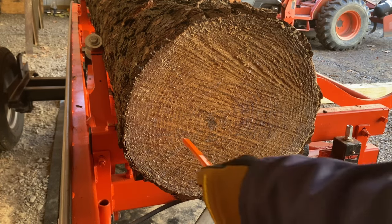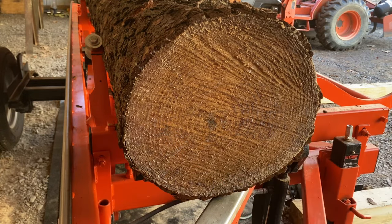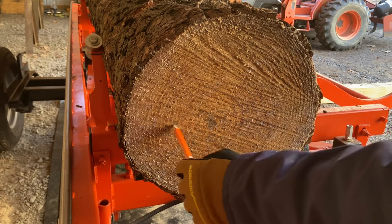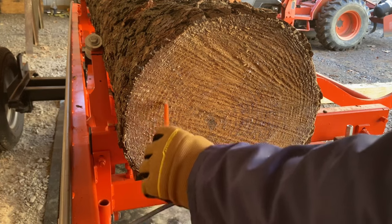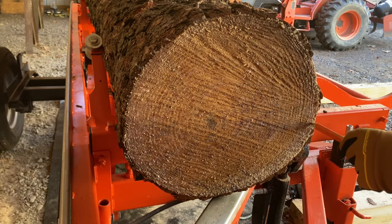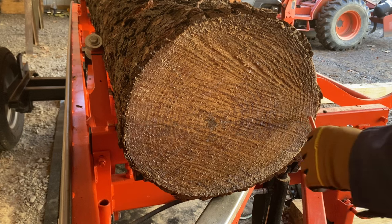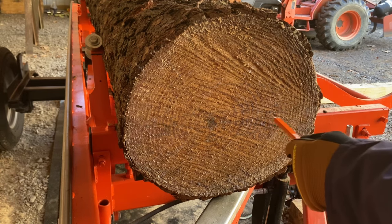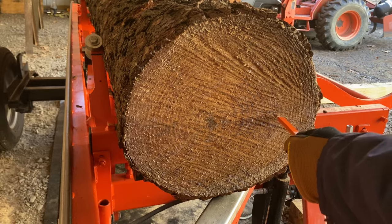You can get them where it's so far off center under tension that it's a waste of time. I've got a tree right outside the sawmill shed here that's a pine about this size — it must be 70 feet tall and it leans over probably 20 feet. I bet you if I cut it down, the pith would be way over to one side and all of the sap rings would be concentrated right over there, spread out trying to keep that tree from turning over.